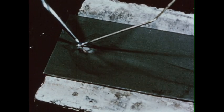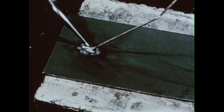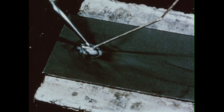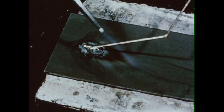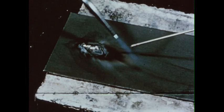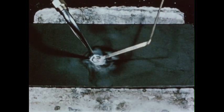Cleaning and fluxing are important to tinning, but so is proper temperature of the base metal. Here's what happens if the rod is applied before the plate is hot enough — notice how the bronze melts off in drops and builds up instead of spreading out. If the plate is too hot, the bronze boils and runs to the edge of the heated area. It behaves like water on a hot stove. That white smoke is zinc being burned out, spoiling the strength of the bronze.